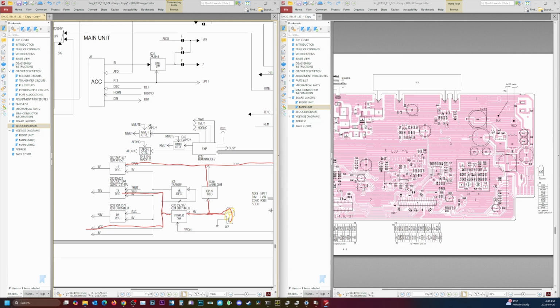Now, I am getting an 8 volt signal, so that must be on. But now, my 8 volts is a little low. It's not too low, but it's down there a bit. Now, I don't know if I'm getting this 5 volt signal here. CPU 5 we have, but are we getting this 5 volt? I don't know. And I don't know if we're getting that. That's supposed to be a question mark. And I don't know if we're getting, so that's transmit 8 volts and that's receive 8 volts.